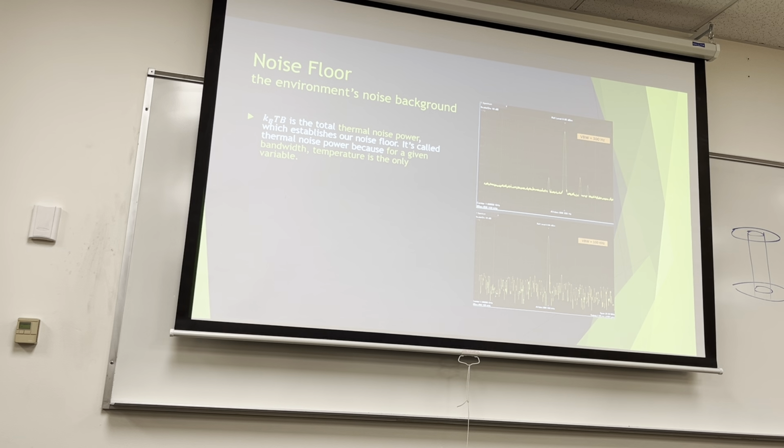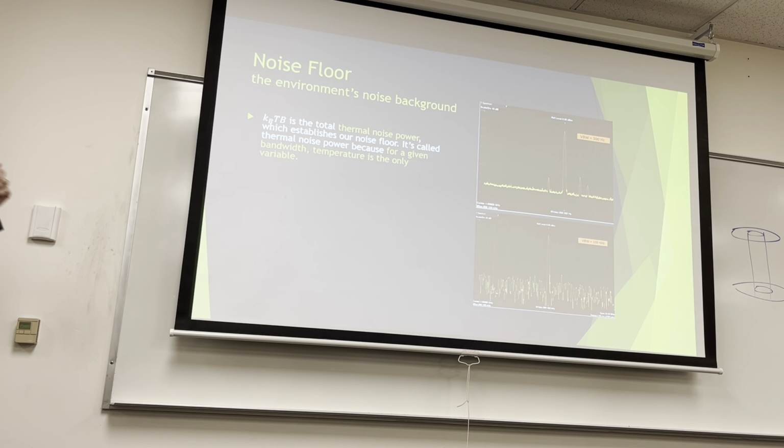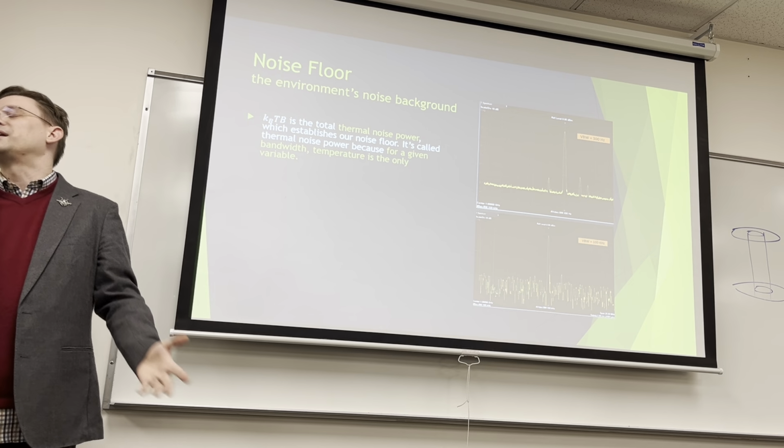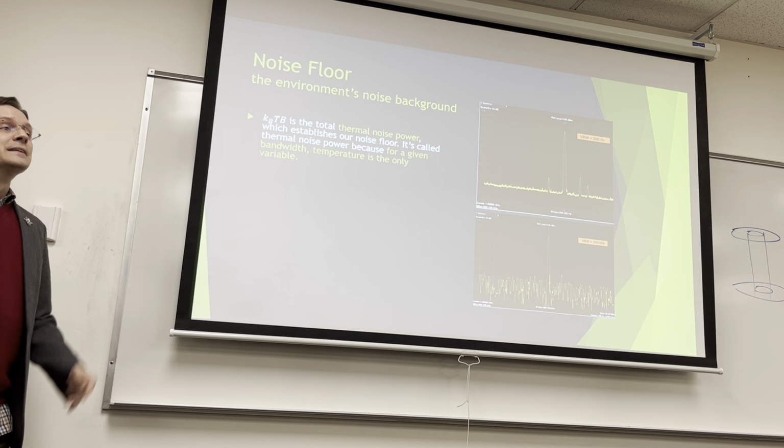So why do you think, let's say, astrophysicists put their observatories on top of a mountain in Chile? It's really cold up there, right? And if you're trying to receive a signal from outer space, you don't know what bandwidth to pick. So they're going to pick one and listen, and then move, and listen, and listen, and listen. They do it in little steps at a time because they can only look at a small amount of bandwidth at a time, because the universe has a cosmic background radiation of some finite value. And if the signal is weaker than that, we can't recover it. And Earth has an atmosphere which is many degrees above zero Kelvin, and that adds noise. So we get it as cold as we can and hope.